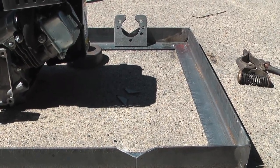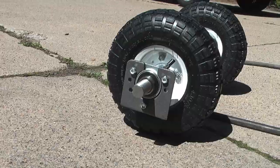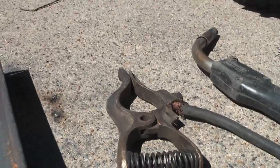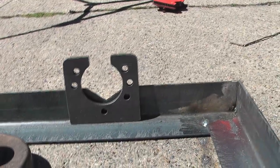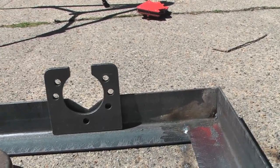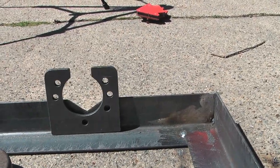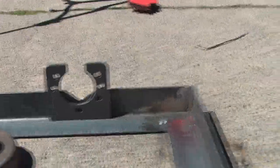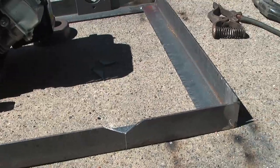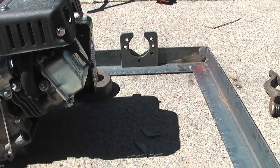There's the other side done. One thing I noticed is that the bearing bracket has three bolt holes but it's only gonna fit two, so I'm probably gonna have to drill that third hole through the frame as well. Good thing I've got a welder because I don't want to take too much more of that frame away. I'll clean up the steel and then try to weld those bearing brackets on.